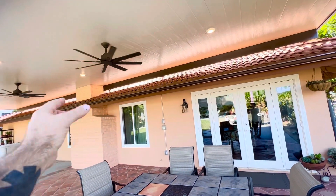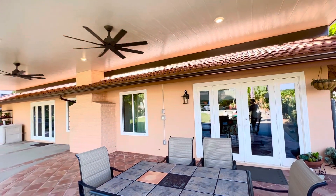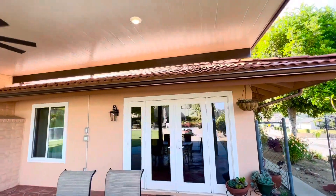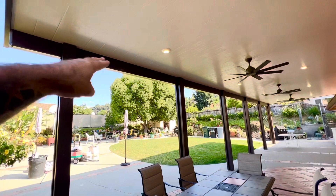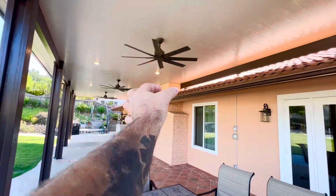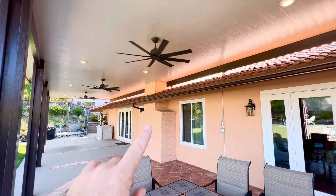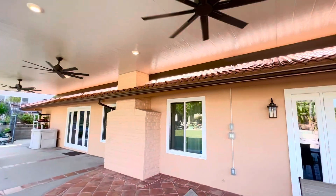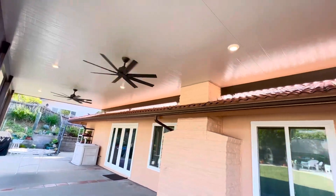We have channel wrapped around that chimney there. But a lot of the strength isn't coming from wrapping around the chimney — it's coming from that roof mount beam lift. We bolt into there, come across, and attach into here. So there's not that much structural grabbing of that chimney. There's not a lot of strength up in these upper beams. The chimney is about in the middle, and on the other side we have another beam with steel in it for that other side.